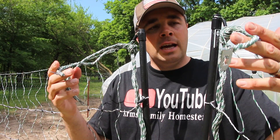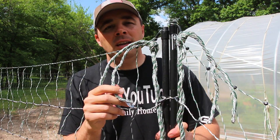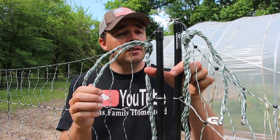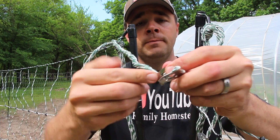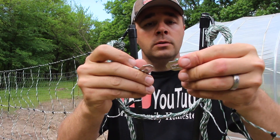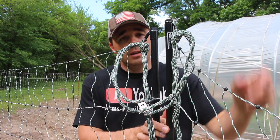Premier One does a really good job of making this all super easy to put together. Once you reach the end of one stretch of fence, you just put your next stake right next to it and start the next stretch. I'm going to tie them together with a piece of string that they provided — it comes with a roll. The way you connect the wires together is with these little clips. You just connect them together just like a little plug-in. There are two separate ones for each roll of fencing. Just push them together and they're all connected, then tie the fence together and take off with the next roll.